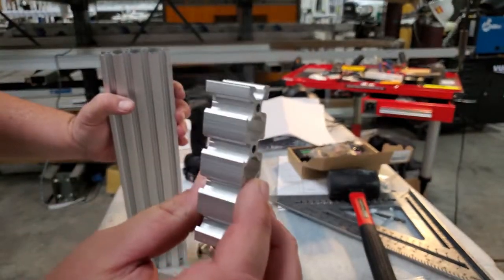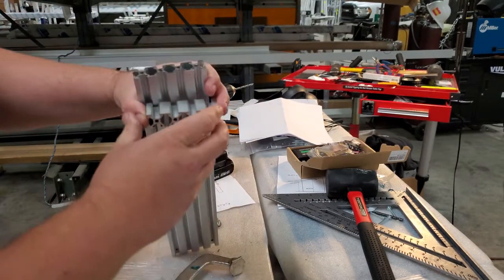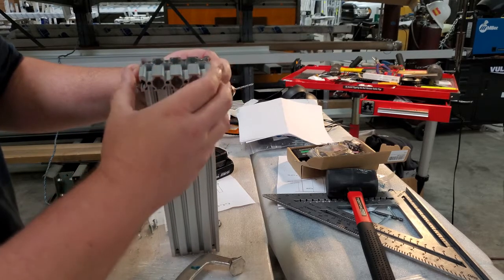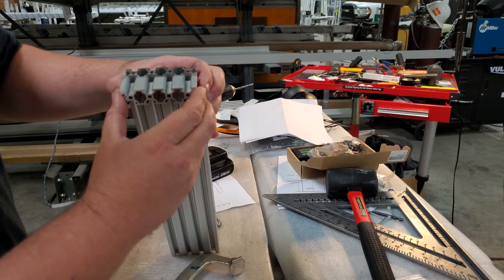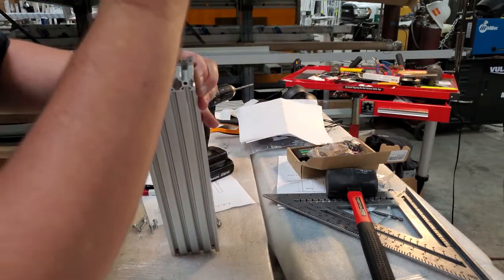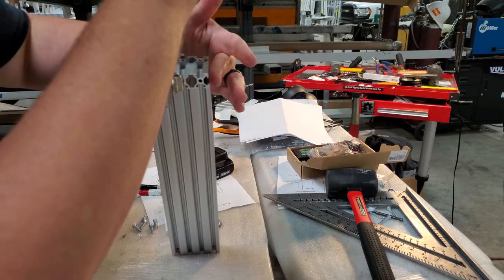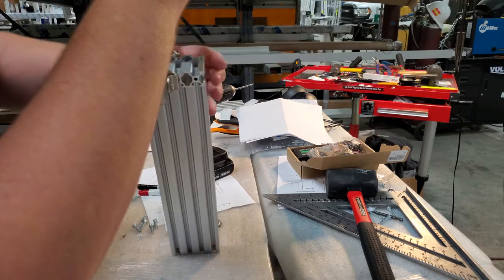What I'm going to do is take a piece about one inch long. If you're able to get a C-clamp, you're going to want to take your one-inch piece, go ahead and align it as best you can. You're going to want to deburr it to make sure that there's no bad edges making a bad connection. Try and get about as close as you can. You can also make a jig where you put a flat piece over here, or even a cap, so you can do this by hand without a clamp.